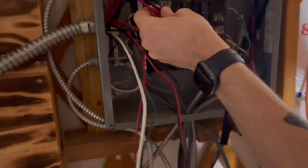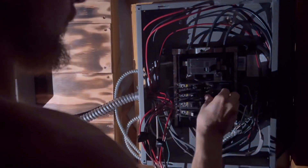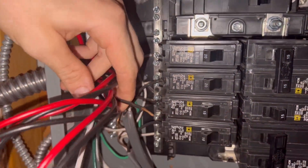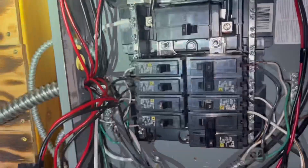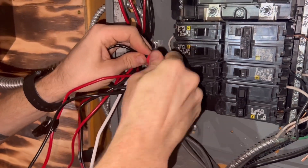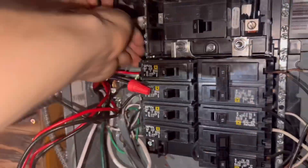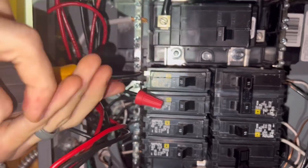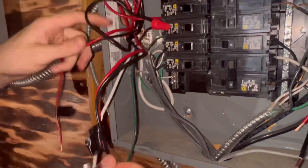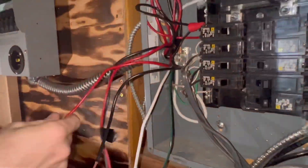You just want to clip your wires to the length you want. We left a little extra length because we will be rewiring this box later once we finish all of our electrical in our yurt. For our setup choice — emergency backup — we're now going to wire the black wire from the transfer switch to the appliance wire in the main panel using wire connectors, as you can see here. Then we wire the transfer switch to the selected breakers and the red wire from the transfer switch to the main panel breaker that the appliance was originally wired to.